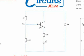In a dark condition, the voltage across the 22k resistor is 0 volts, so VB is 0 volts — the transistor is off, and when the transistor is off current cannot pass through, so the LED is also off. When it is bright, the voltage VB increases, turning on the transistor, allowing current to flow through, and the LED turns on.